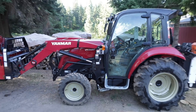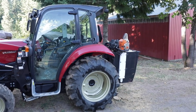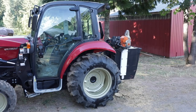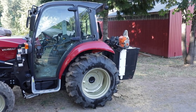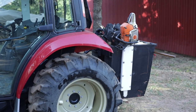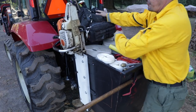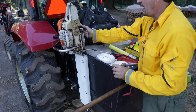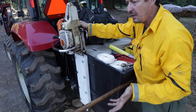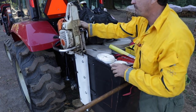If you're going to hang a bunch of heavy water weight off the front of your tractor, you need something heavy in the back as a counterbalance — put your mower on or something. I have a weight box, and I chose that over a mower or rototiller because it keeps the tractor compact and gives me vital storage area for equipment I really need. First thing I want to have is a chainsaw, especially if you live in timber. Having a saw helps with fire problems, and if you get trapped — snags and trees fall down in fires all the time — you might not be able to get out.